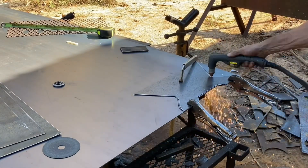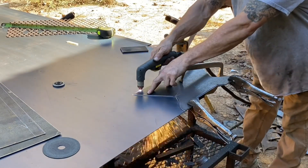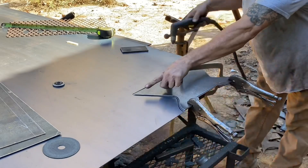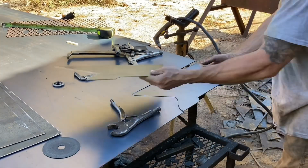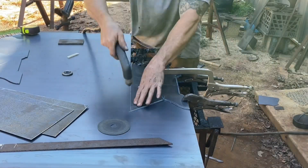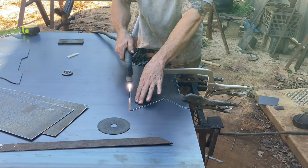This one's cut a little thin — I cut this one out of 16 gauge, which is a little thinner than I like to use for a template, because you're more apt to pop over the side and mess up a little bit. It usually doesn't mess up too bad, but sometimes it does. I prefer like an 11 or 12 gauge thickness for a template.